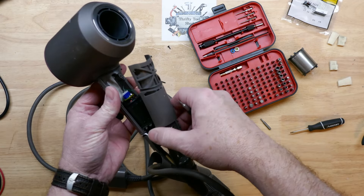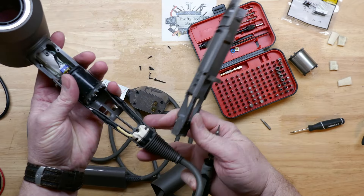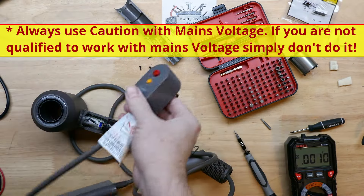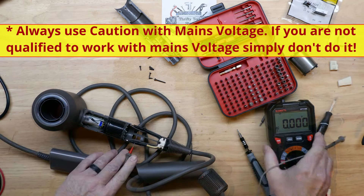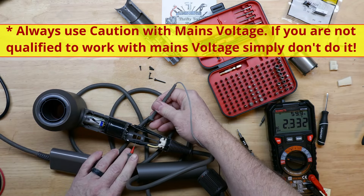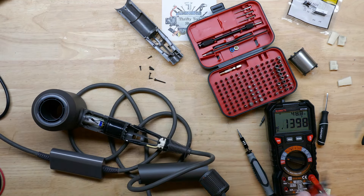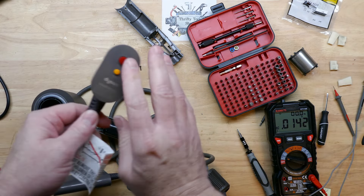This half will pop right off except it's got a little bit of tape right there. I'm going to be very careful — I'll plug in the GFCI and make sure it's reset. With my sharp meter probes I'm going to penetrate this heat shrink and make sure 120 volts is getting through — and it is. So now we'll unplug.